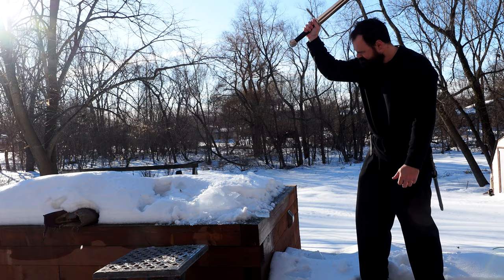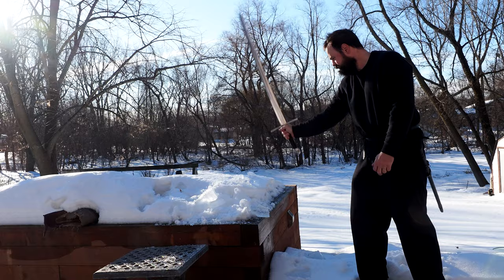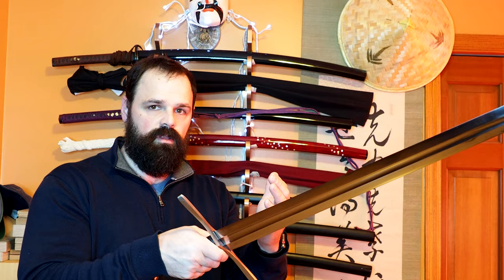sword around. So one tip and one thing that I think has been a consistent recommendation to Musashi as they go down the path of making European swords, from the people that saw this video when I unboxed it and gave my initial impressions, is there should be more distal taper here. This should thin out, and the point of balance should be returned a little closer to the hand. This really should be a lighter sword for the size of sword it is. And I think most of the weight is coming in from almost a complete lack of distal taper, as in it's about as thick here as it is out here.